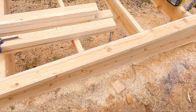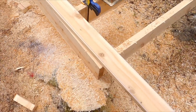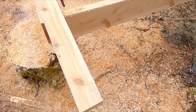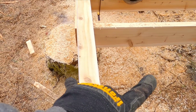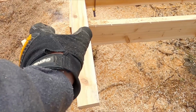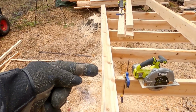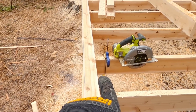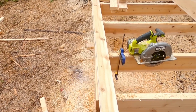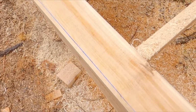It'll take a while to make up my mind whether or not cedar is good for framing, but it is quite warpy depending on the part of the tree it comes out of. This one was cut out of a really fat board, so just taking off one side of it, and that outside line, this side was ripped straight, and then all that was left is the bark on this side. I just took the bark off that side, and I sized it down again, and look how crooked it is. I just snapped another line on there.